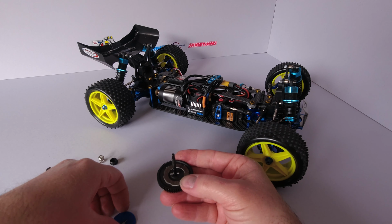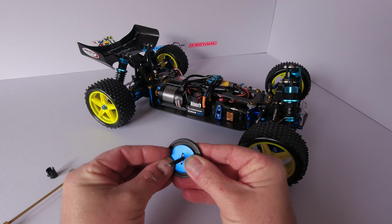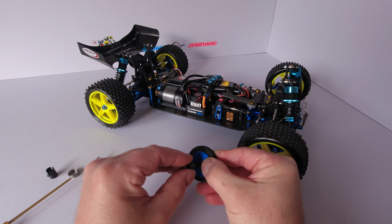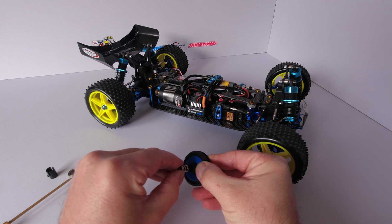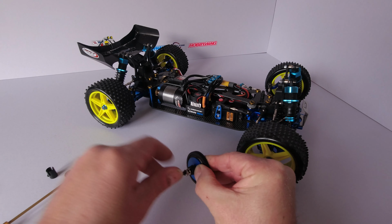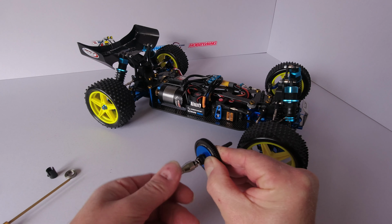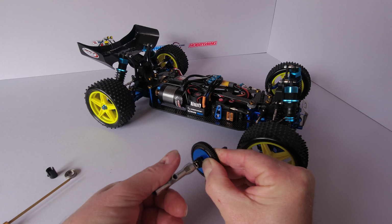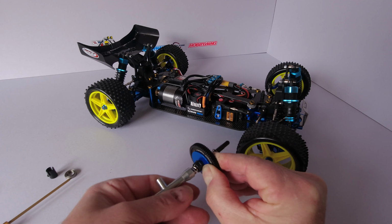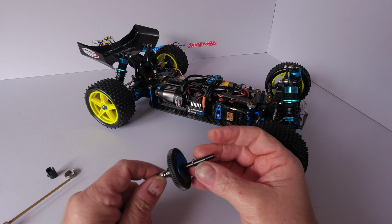Right, now start assembling it back up. There we go. Centralise the gasket. Okay. Spring holder back in. Spring. Nut. In that order. Start tightening that back up. Now, I'm unsure if there's a certain tension on this spring. So I'm going to do it to what I think is the correct tension. And then just leave it at that for now. Might need adjusting later on.